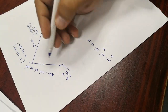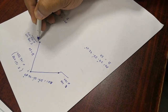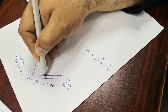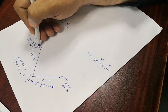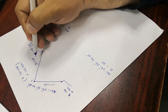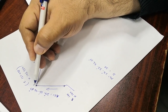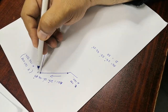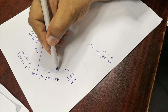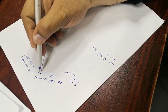For example, I have one point here and another point at the other end. I know the coordinates of both points, but the problem is I don't have a benchmark. In this case, from one point I have only the bearing (azimuth) direction to the unknown point, and from the other point I know the distance. Using the Leica TS09 Plus, I will show how to calculate and stake out this third point with only bearing and distance as references.